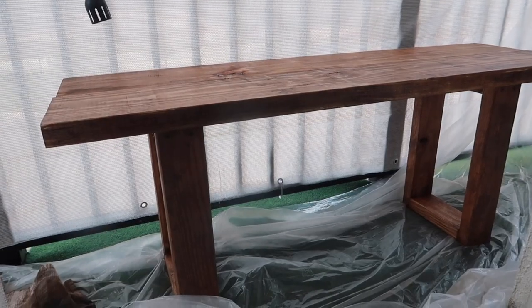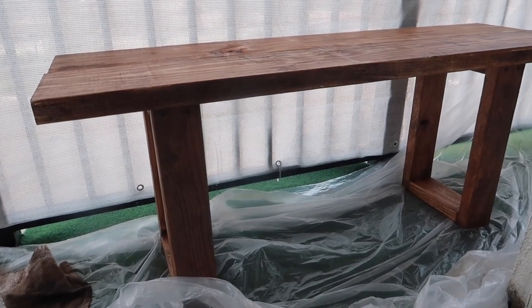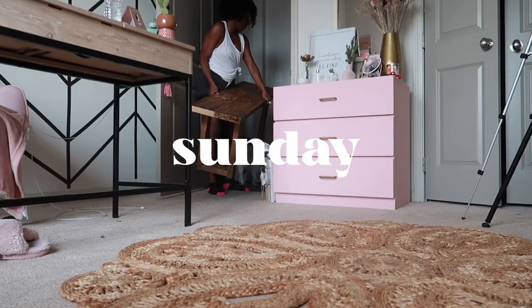So I went back to my tried and true and pulled out Provincial 211, staining the entire bench with very light coats. Provincial 211 is a dark stain and I was afraid it would look similar to our wooden floors. But once I applied that light coat and let it dry, it came out exactly how I wanted. I'm taking a bit of a break — I started at 11 and it's currently four o'clock, but that includes running to the store and playing around with colors. You do have to let the stain dry in between coats.